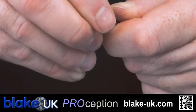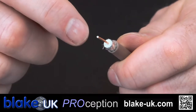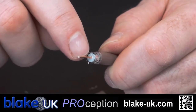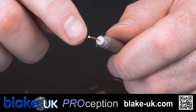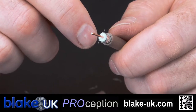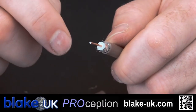You want to leave some of this braiding — that's the shielding for the cable, it stops interference getting into the cable. Be very careful with the little pieces of metal, the little pieces of wire that come off. You want to be sure that these little fine wires aren't touching the centre core. If even one strand of these fine wires is touching the centre core, that causes a short. The downside to the short would be two things: one, it causes attenuation to the signal, and two, it will stop any DC voltage travelling. So if you're using an amp, perhaps a masthead amplifier, or you're connecting it through RF2 on your skybox, this will stop power travelling around the system. So very important that not one single strand of that fine wire is touching the inner core — I can't stress that enough.